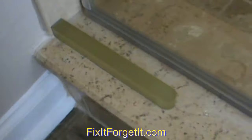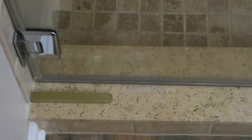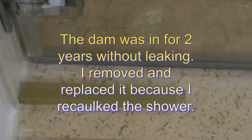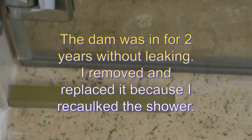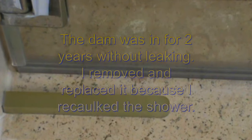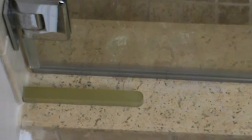What's really nice about making a urethane dam mounted with the 3M exterior double-face tape is that water will just sit there and over time drain back into the shower and dissipate — you never have to worry again about caulking breaking down or a barrier that will fail. I don't know exactly how long the double-face tape would last, but I bet you could get at least five, maybe ten years out of one of these. The urethane isn't going to degrade, and I've used that tape outside for many years. So if you make yourself a dam like that, you're going to be set for a long time.